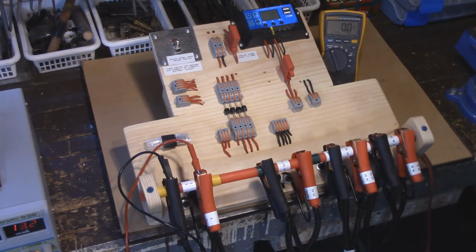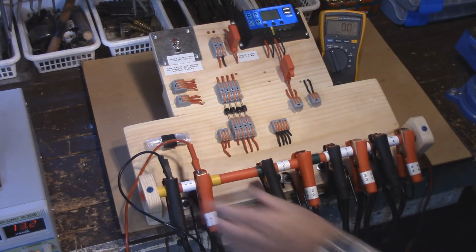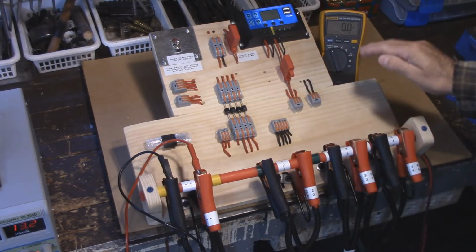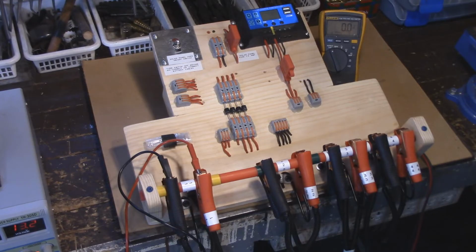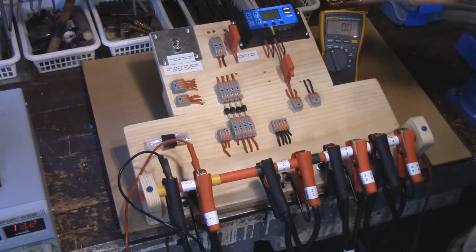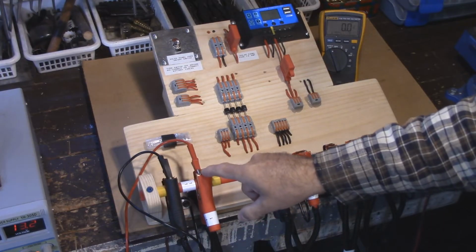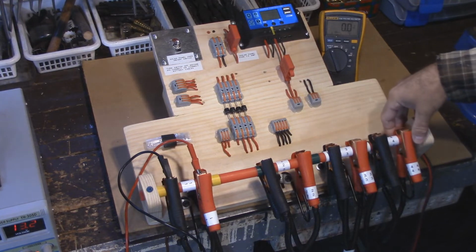When it needs to charge this master battery cable set here, well then it also charges all of these. And when it charges up, it shuts off, all because of this master set right here. That's about as easy of a setup as I could figure out, where none of these battery cables attached to all different batteries ever know that they're attached to the charge controller. The only one is this one here. So this is completely isolated from these three.